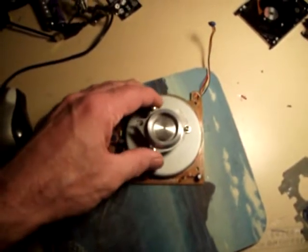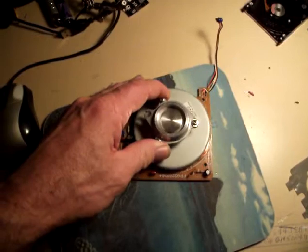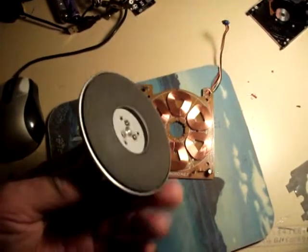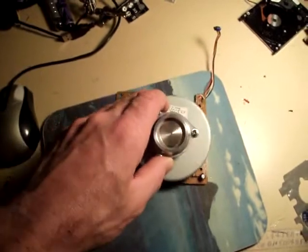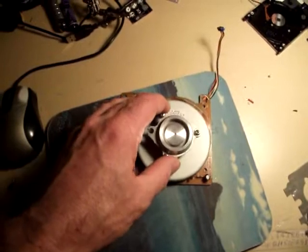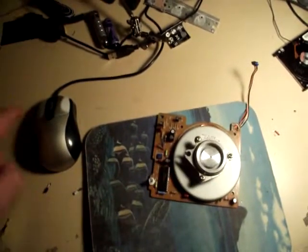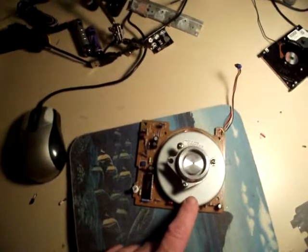So either you're happy with a very low voltage output, or you reconfigure this somehow so that your VAWT, when it turns, is offset — so it wouldn't be direct drive. Your VAWT would then turn a large wheel, for example, and then it would belt down to this.